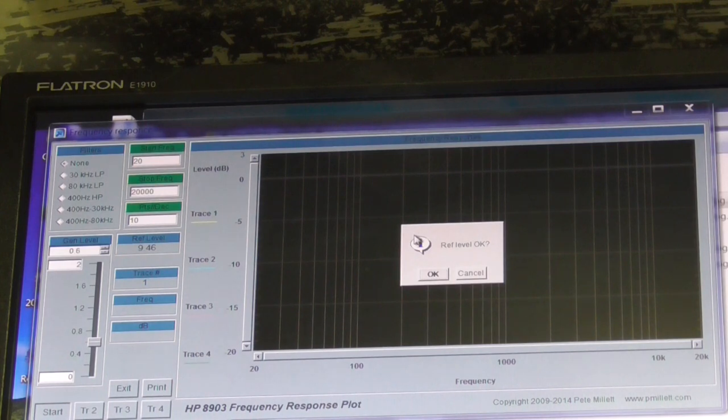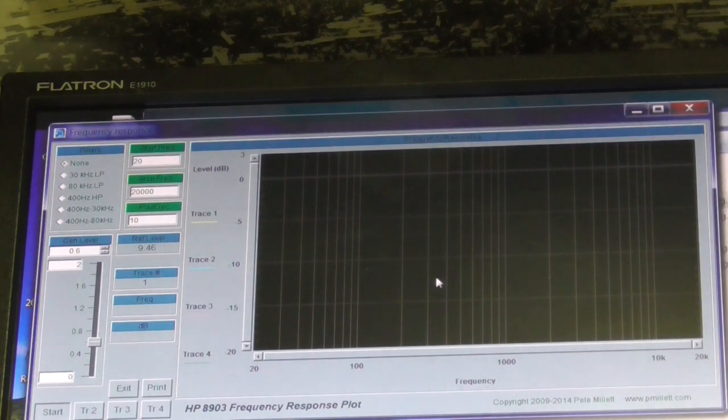Are we at 200 millivolts? Got a lot more drive level, actually. I've noticed that. Let's try it. Start. Okay. Which I suppose we would have if we altered the series component. Right, I want to peg that in pretty quickly. Oh, yeah. Wow. That's much better. Look at that. You see, before, it shot straight off the line. But now we've got a pretty good flat response. I'm very pleased with that.